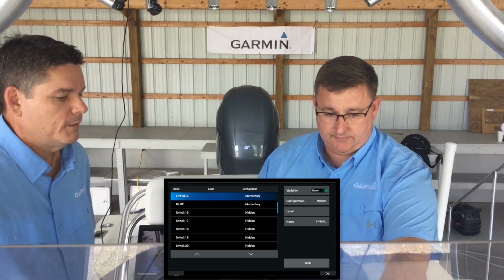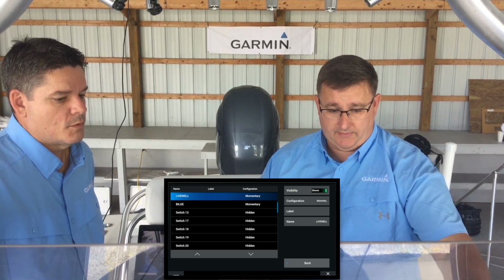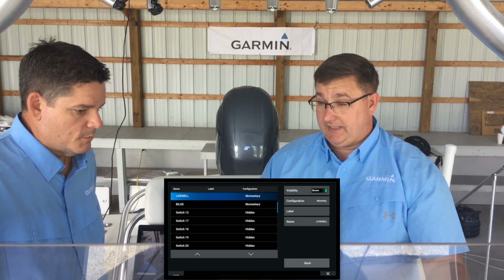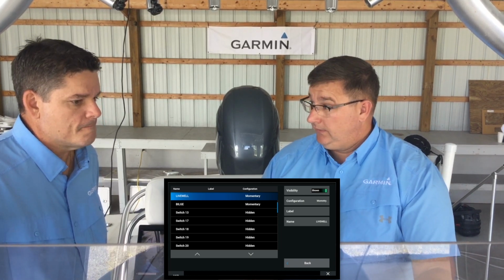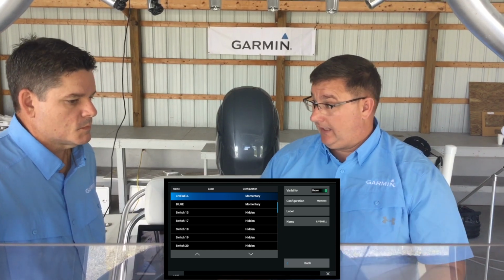Yes, that's correct. When it's momentary, you're sending the signal, so it'll turn off and turn on. So we want everything to be momentary. For example, if you set latching on your horn, it's going to go off the minute the system comes on and stay on, and you can't turn it off.